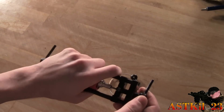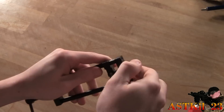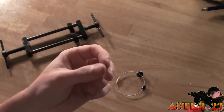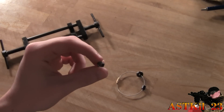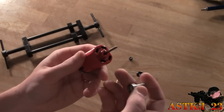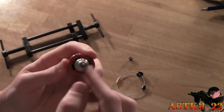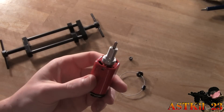Once you have the pinion pressed all the way out, you have your motor — set that aside — and your old pinion gear. That was pretty easy. Now, once the pinion gear is off, you can replace whatever you want: the shaft, the internals, the motor. I've seen upgraded bearing versions of this little part. But this motor isn't working right now, so let's just go ahead and put the pinion back on.